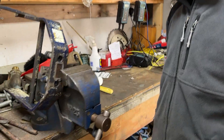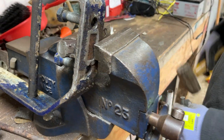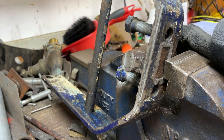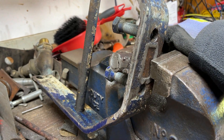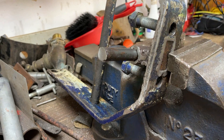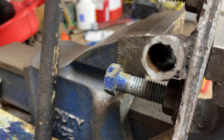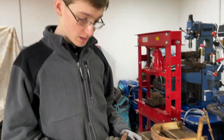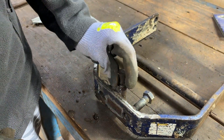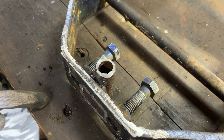We're over by the bench now and we have the sleeve hitch clamped in the vice so that we can try and take out that centre part. I've got a mallet and a drift and we're going to see how well this moves — ideally this will just come out from me hitting it. And it doesn't look like it's left too much damage to the hole. Pretty much one hit and it was loose when it came out. Unfortunately that has left a non-circular hole there, so there's going to have to be some repair jobs done there. Also the outside of this needs more cleaning up too.